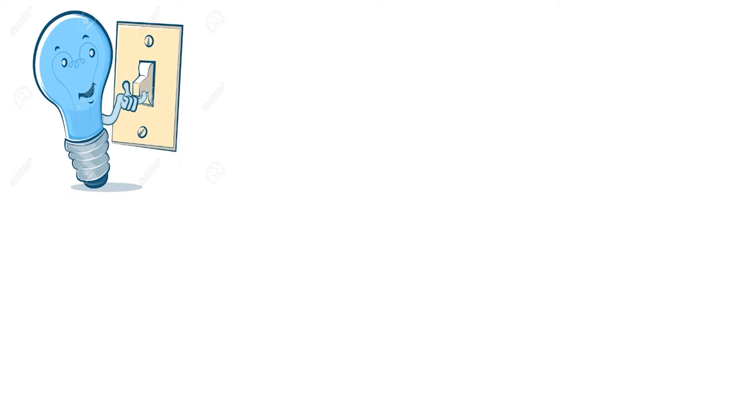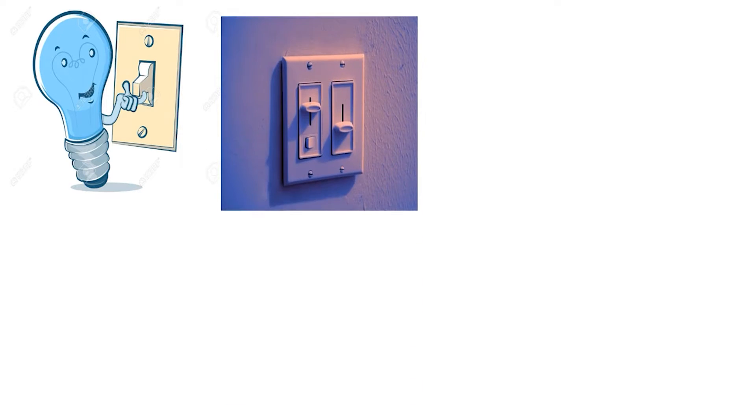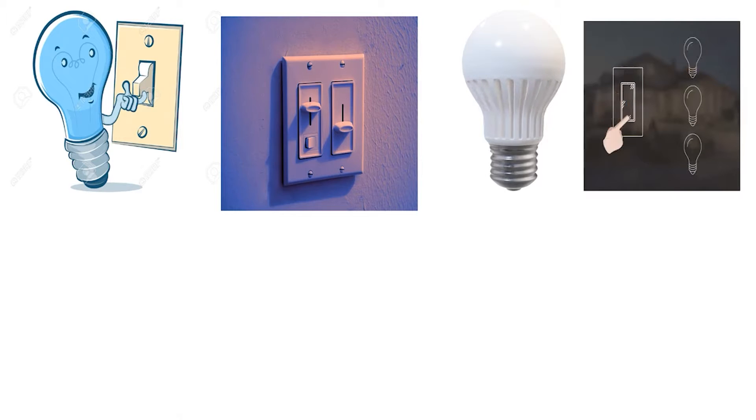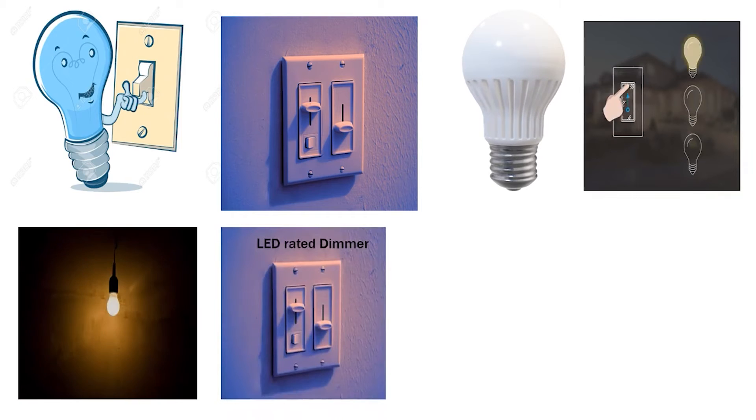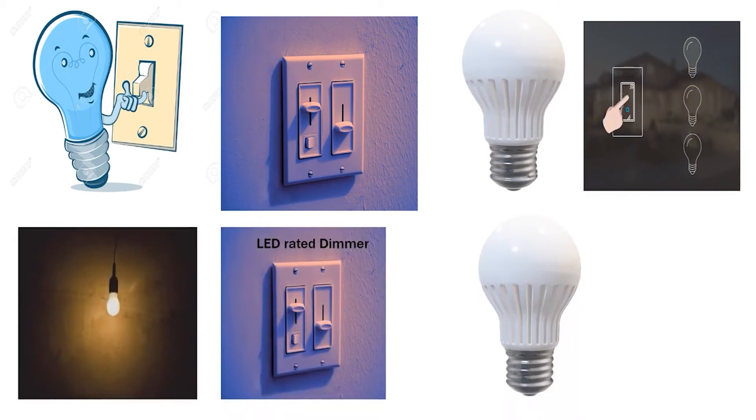As we go through the work, we're going to learn more and dive a little bit deeper into LED dimming technology. A dimmer looks like this — you know, some of the old school dimmers, they still make dimmers that look just like this. Say a customer calls you out, they've installed that dimmer, popped a new LED in there, and they're expecting the circuit to work — boom, light shines, no big deal. But instead they end up getting flickering.